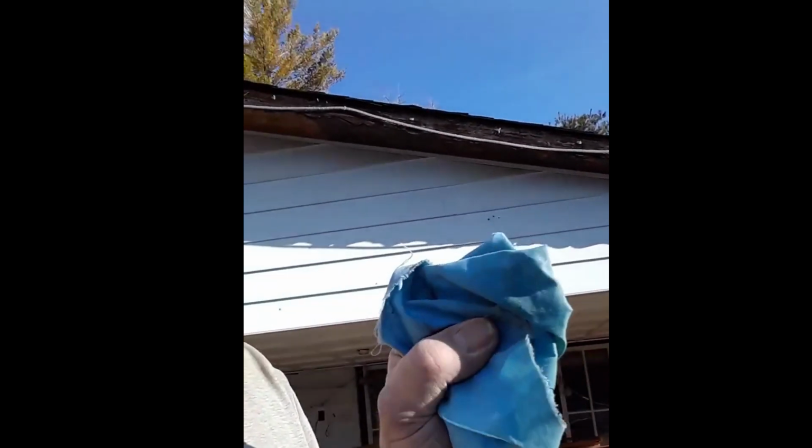I'm just going to apply it with a rag. So clean cotton rag. And all I'm going to do is put some on the rag and then wipe it on the canoe. And fairly liberally apply it. You don't have to go crazy. You want to do some light, thin coats, but get it soaked in to all the screw holes underneath the gunnels particularly. And the first thing I'm going to do is flip the boat and get it nice and tight on the bottom of where the gunnel meets the hull and make sure that's well sealed, because as you saw earlier, that's the part that really gets a lot of weathering.